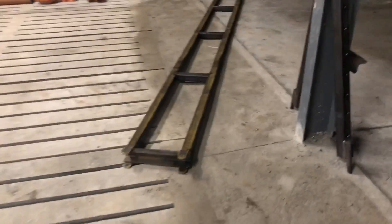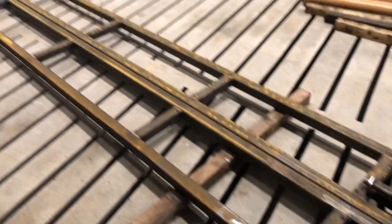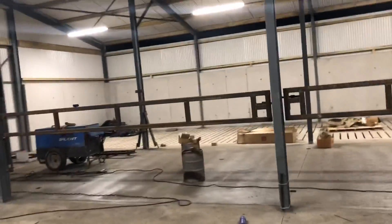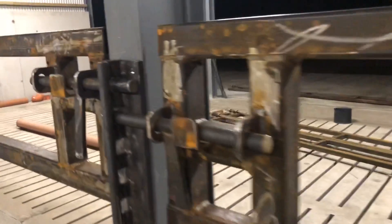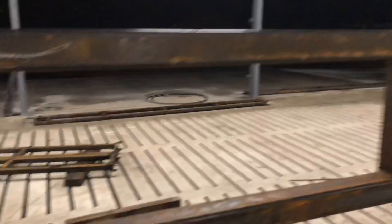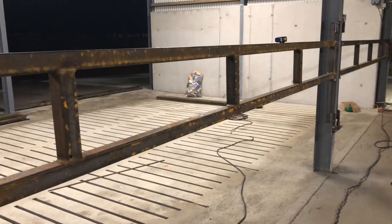As you can see, some of our barriers have arrived — also on Saturday — and we've started to pre-fit some of those before they go away for galvanizing. The barriers themselves are made out of two-and-a-half-inch heavy-walled box section, so they're built to take a little bit of abuse from the larger bulls that we'd be feeding from time to time. They are fully adjustable so you can also drop them down for smaller cattle, weanlings or whatnot.